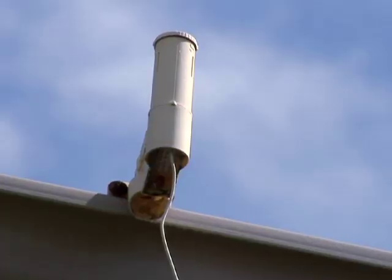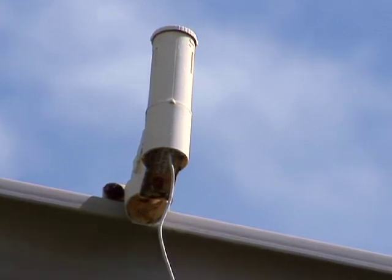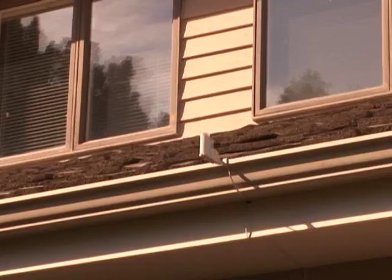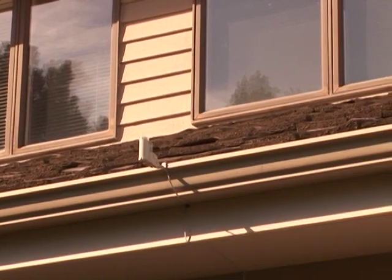You want it mounted in a location on a roof so there's no interference from the sprinkler system. If it's in full sun, both devices will dry out faster and the system will come on in a shorter period of time. But if your irrigation system is in all shade, you don't want to mount the sensor in full sun. What we're really trying to find is a location that's open and relatively homogeneous for the entire irrigation system.